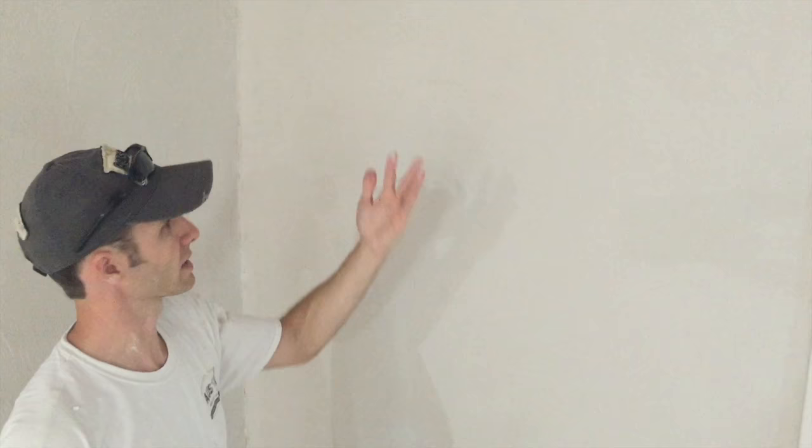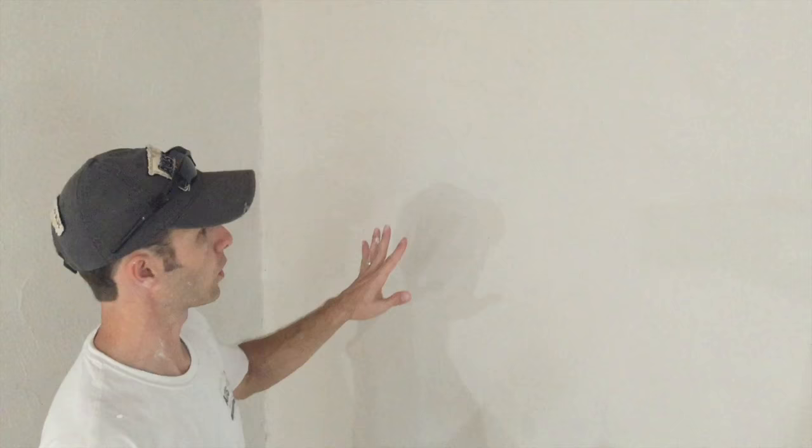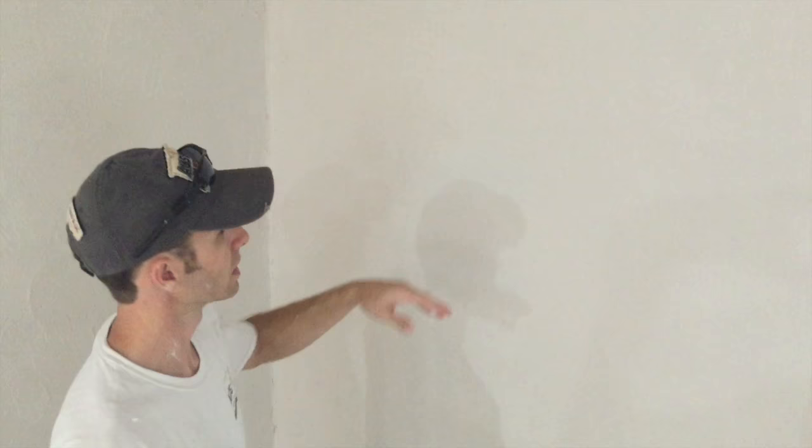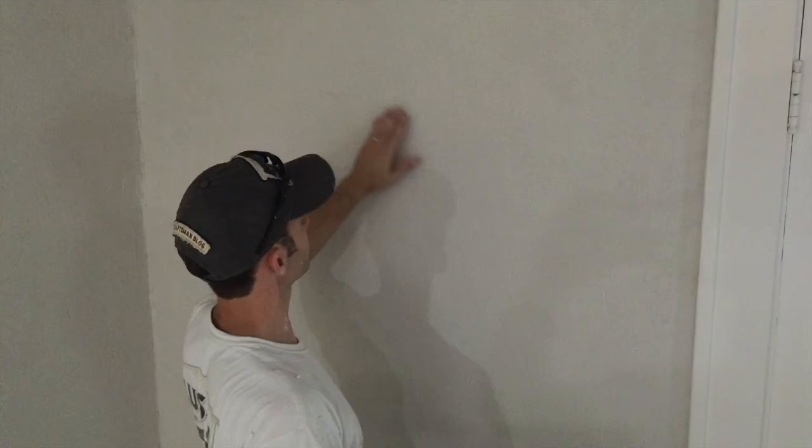The knockdown process is what you use to smooth out and finish the plaster. You can do a trowel finish, or in this case we're going to do a trowel and then a sponge float, which we'll talk about in just a sec. There are some ridges in this plaster we want to resolve — the sponge isn't going to resolve all of that. We're also compacting and polishing the plaster, making it harder so that when it's fully cured it'll be a really nice finish. You've let it set up for 10 to 15 minutes, could even be 25 to 30 minutes — it really depends on the temperature, the humidity, and a lot of different conditions. You know it's ready to knock down when you put your hand on the wall and you're not leaving fingerprints.